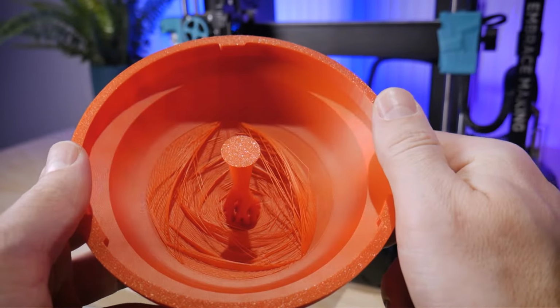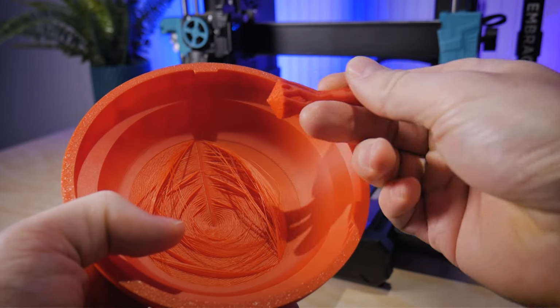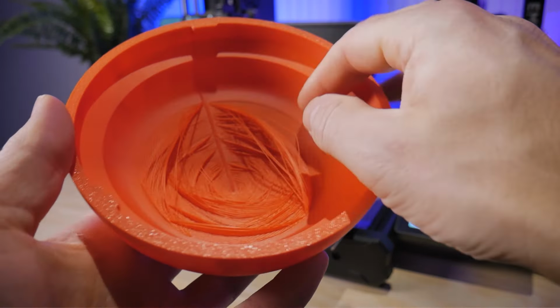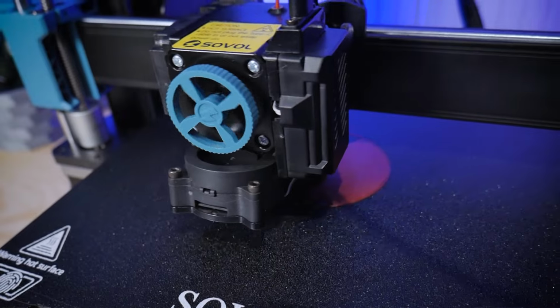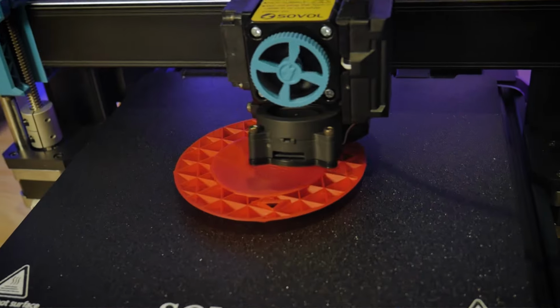It was the underside of the dome near the top that was the messiest, and this is where those layers transition into extreme overhangs. The perimeter walls in this section do not have very much surface area to attach to the layer below it, and they'll separate from the model and look very stringy like this, so I will have to do some post-processing and cut those off. The inside of that part will not be visible when the assembly is complete, so that's why I printed it like that.